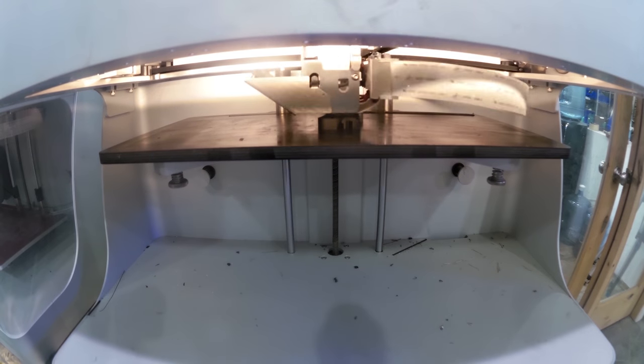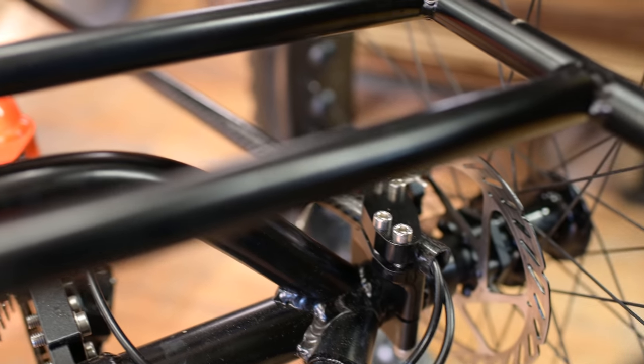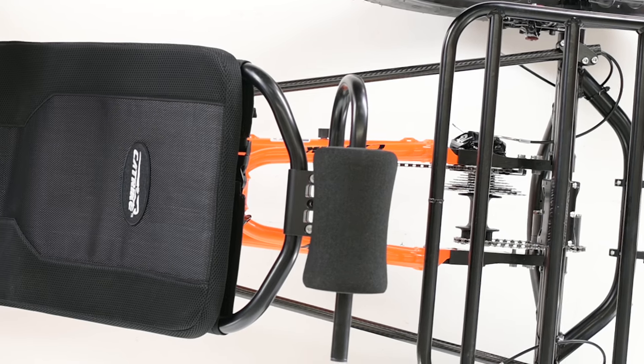We had to make our own mounts, which was a process all its own. Luke designed a mount in SolidWorks and then 3D printed a carbon fiber prototype to make sure it fit. Afterwards, we machined out the same part in the mill and powder coated it in a nice satin black. With the carbon fiber tubing, the Dumont does lose its folding capability, but really there are no quads that fold. Yet, maybe we should look into that.